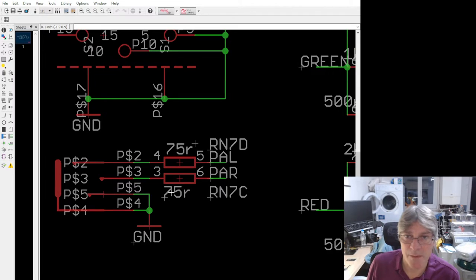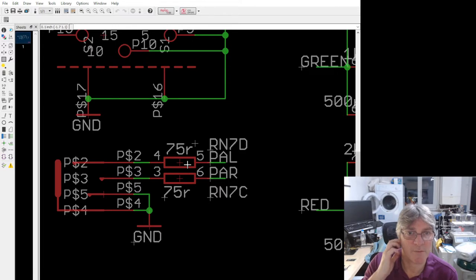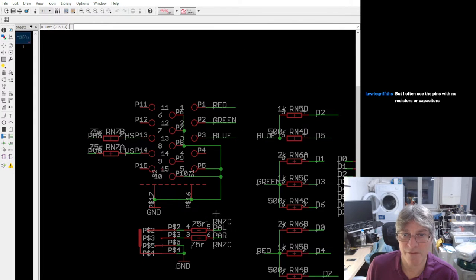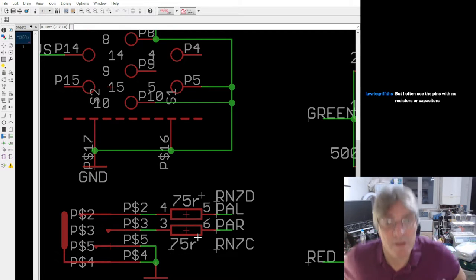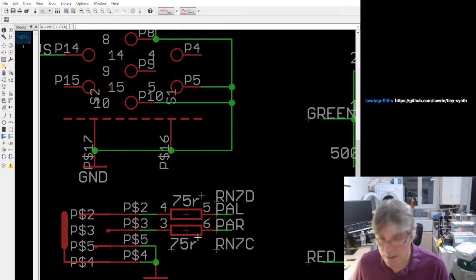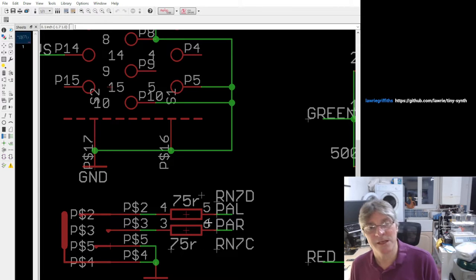At 3 volt, you're going to be a bit limited, and it has a 75 ohm impedance. And I'm just reusing the other two 75 ohm resistors I have in the array, so I'm using two of them to do the synchronization signals here, so they were left over. So it provides a little bit of resistance in line with the coil. So if you do attach it directly to something with a low impedance, like an 8 ohm impedance or something, like a speaker, then it will limit the current a little. Stop the FPGA from gasping as it has to try and deliver the current.